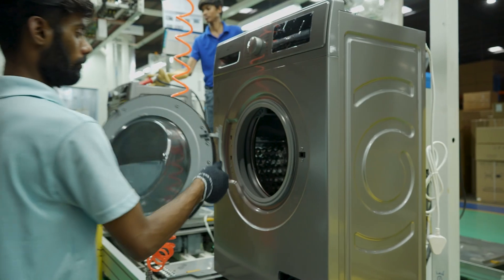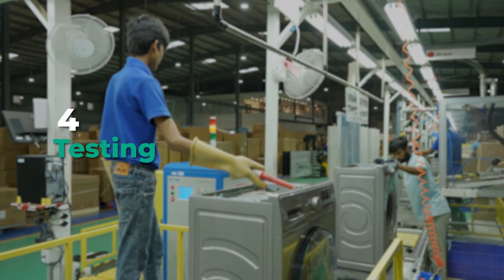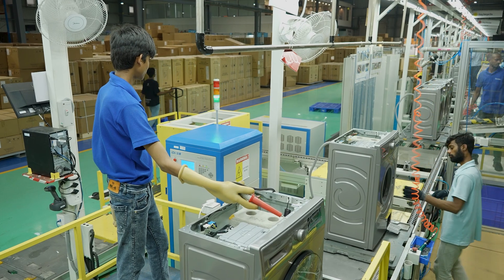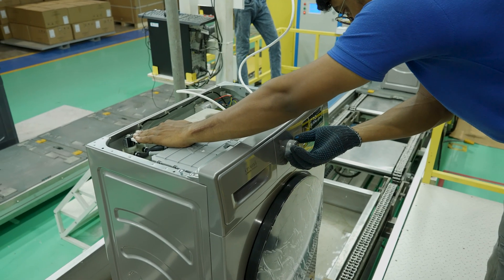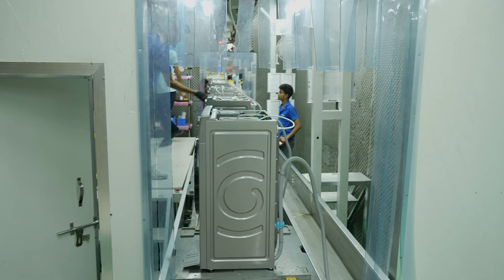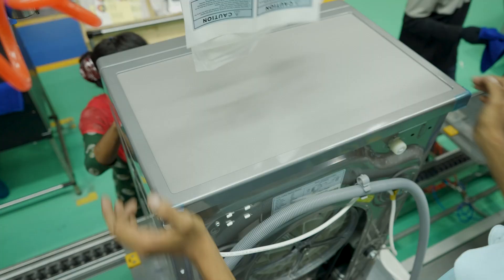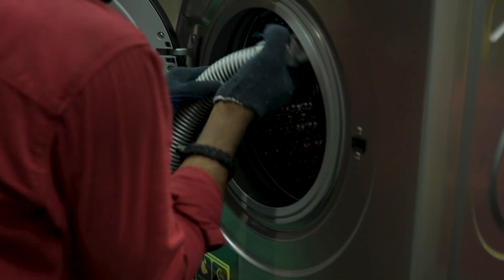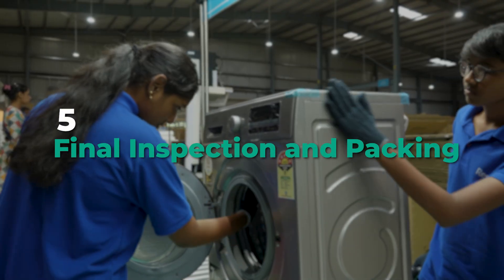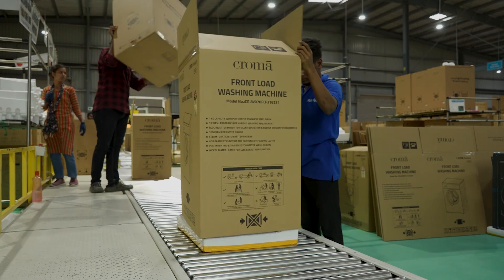Once the water is in, the door can finally be added on and we are ready to run the test cycle. The test cycle comprises electrical and functional tests where all major functions of the washing machine are set in motion, including checking for maximum RPMs — that is rotations per minute. The machine also undergoes a water flow inspection for leakage and a noise inspection for any abnormalities in sound levels while in use. This is also where smaller remaining parts like the top and back panel are added. After the tests are done, stickers are added to the washing machine and a deeper thorough drying process is done. After a quick final inspection of physical elements, the washing machine is now ready and is put in a box along with other accessories like the pipes.